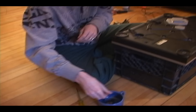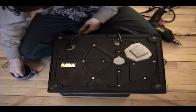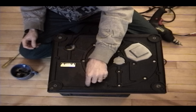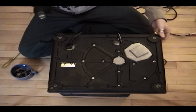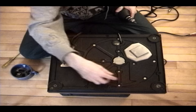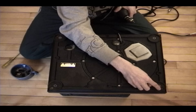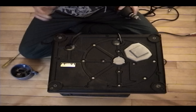Put them in your little bin of parts. The fat washers go under the platter right here where the circle is, and the longer screws go on the sides. One of them is actually right under the start/stop button — that screw doesn't attach directly to the aluminum, it attaches to a plastic piece connected to the switch. When putting it back, don't torque it too much or you'll crack it.